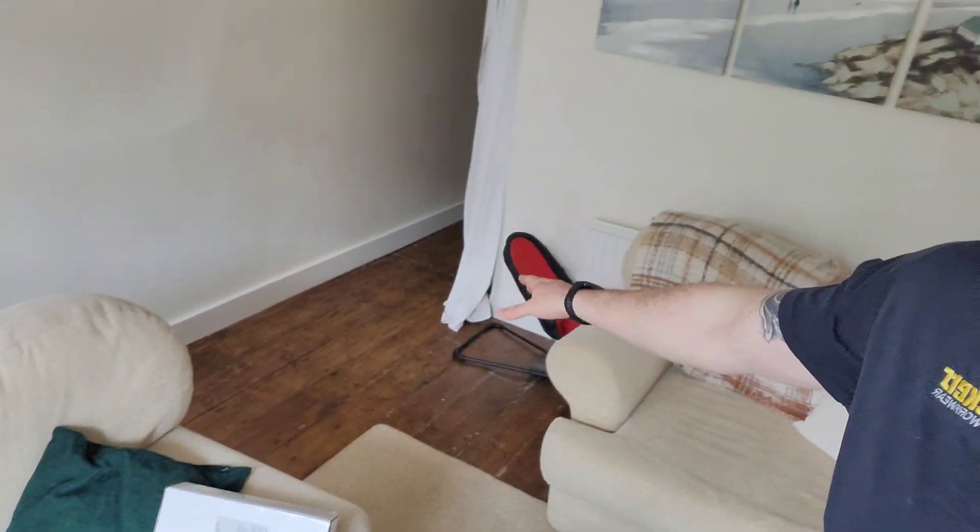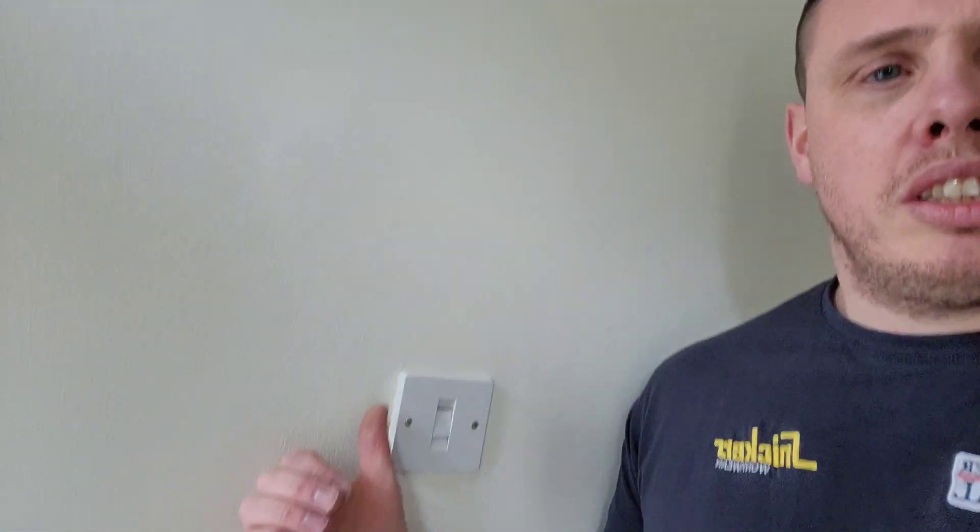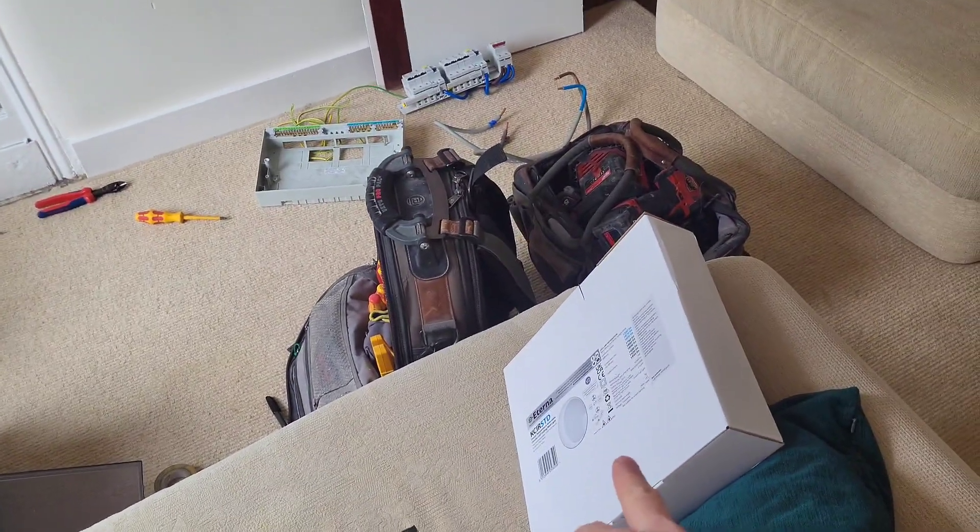We need to re-terminate all light switches. The connections for the pendants aren't actually independent. When doing the EICR, there are built-in wardrobes, PC tables, beds, carpets — the lot. You can see it's not just floorboards upstairs, it's all carpet. There's no way we can start taking carpets up. In an EICR you set agreed limitations — you're not removing decor, floorboards, or carpets. You're there to visually check the installation for continued safe use. You can't go taking plaster out of walls in a rental.